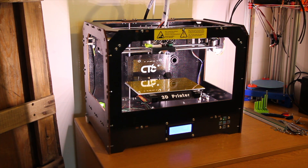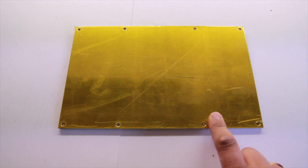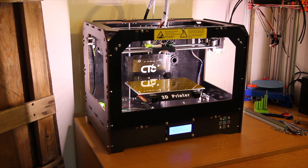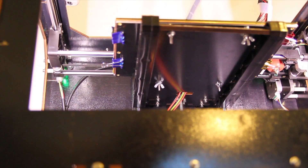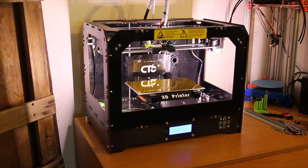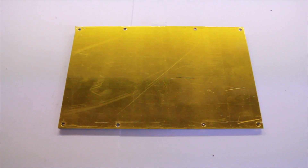On this video I'd like to change my heated bed. Currently it's an aluminium bed with Kapton tape, fixed to the Z-axis bed. The issue with a fixed print bed is that when the print is done, I'm in the machine trying to scrape the model off, which can disturb the bed and mean I have to re-level it — and it could damage the printer by putting excess load on the heated bed. So I want to replace the poor-quality aluminium with a copper plate and have a removable borosilicate glass bed. Removable means when I finish a print I can take the glass out, let it cool, put another piece of glass in, and carry on printing.